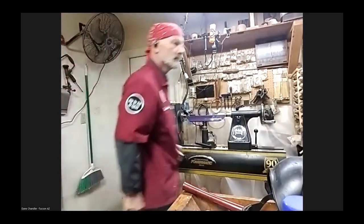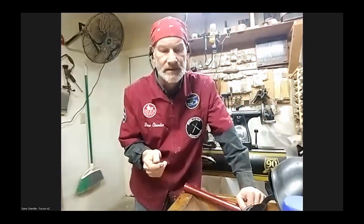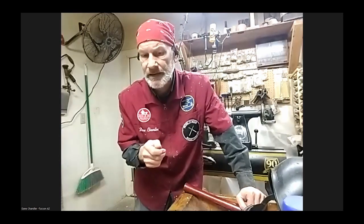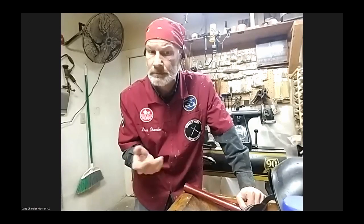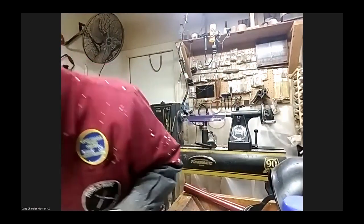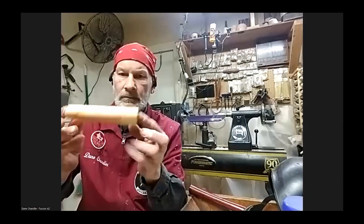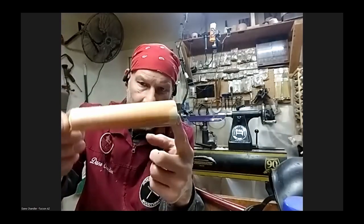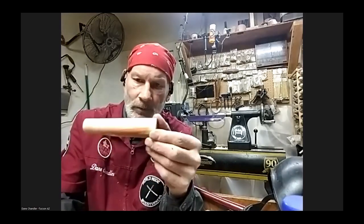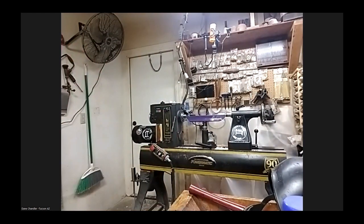Here's the thing — if you shake it up and you think it's too watery, you could just add a little bit more dye. But what you want to do is put it on your test piece and see what that reaction is, because depending upon the wood, it'll absorb at a different rate, and it'll change color too. And then like with all other dyes, when you put your final finish on, it'll change colors as well — it'll make it darker. So straight away on a piece of pine, first coat, not much. But as you keep applying it, it'll get darker. You can make that cherry red, as an example. I've got a piece of scrap over here. And so that was a piece of mesquite.